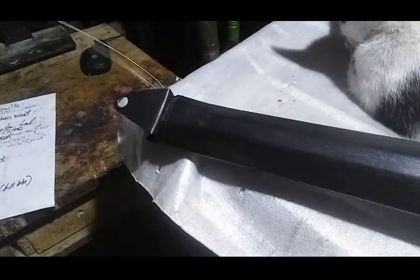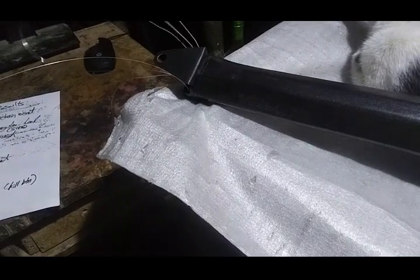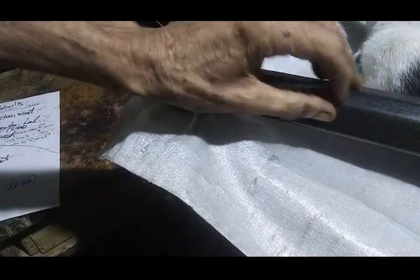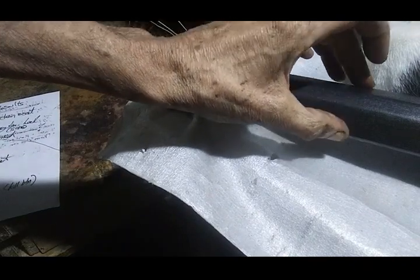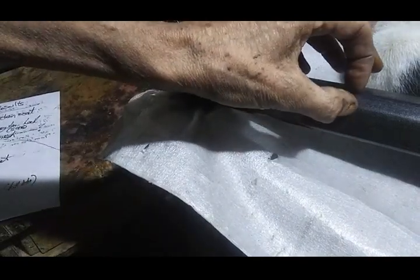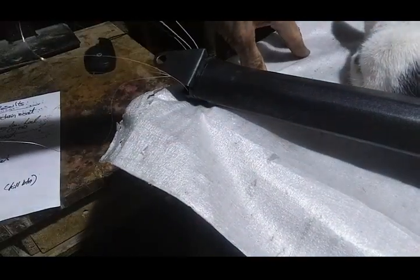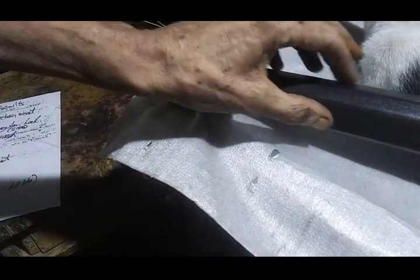The trapezoid neck profile — basically the ideal profile is 20 millimeters thick and then it's just three sides: a 10-millimeter wide spine, and then it goes from the edges of the spine out to the bottom edges of the fretboard. If you want to get super radical you can take it from the edges of the spine to the top edge of the fretboard and roll that edge, but there's not a lot of material left to roll, so I usually shoot for the bottom edge of the fretboard.